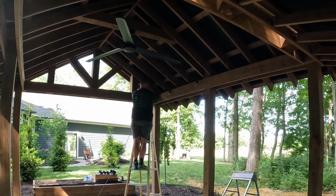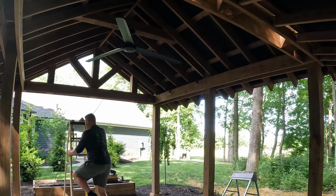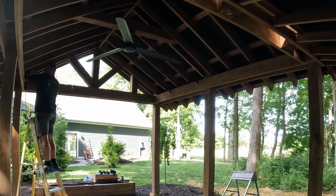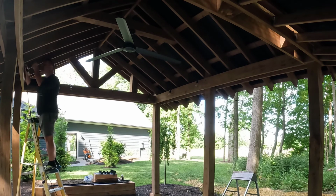And I'm just going to do a ring inside the main portion of this smokehouse, and then I'll do a row of them behind the smoker, actually in the lower portion. I think I forgot to record that. I do run a strip down there along with some additional lighting that I'll show you here in just a second. What I was saying is I did run 2 circuits out here, underground, direct burial, 12-2 cable or wiring.